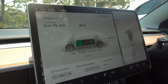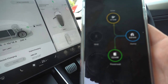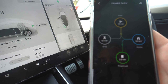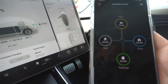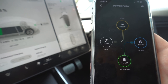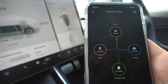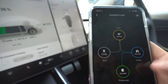We've ramped it down to 10 amps, down from 16 amps. Looking at the Powerwall app now, we can see we're grabbing about 7.5 kilowatts from solar, and the Powerwall is filling in the rest at 2.5 kilowatts, sending that into the house. Basically full charging completely from the house — nothing from the grid — a combination of Powerwall usage as well as solar. I'm going to step it down again and see if we can get this going just from solar, based on the Tesla app and the time-of-use settings I've currently got set.